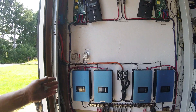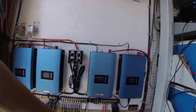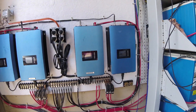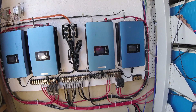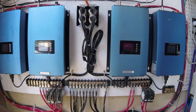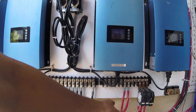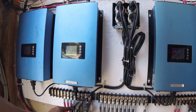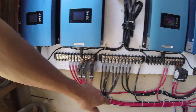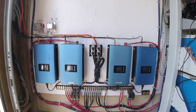These things work really good — I think they were $260 a piece. I had a whiz bang junior to determine my usage, but it just didn't work right the way I have this configured. This is all common return. These are tied together with six-gauge wire. I've got one battery string here and three battery strings here — because I changed the configuration to a common battery string situation.